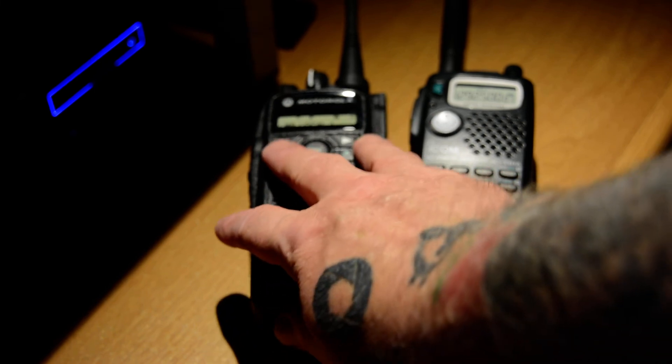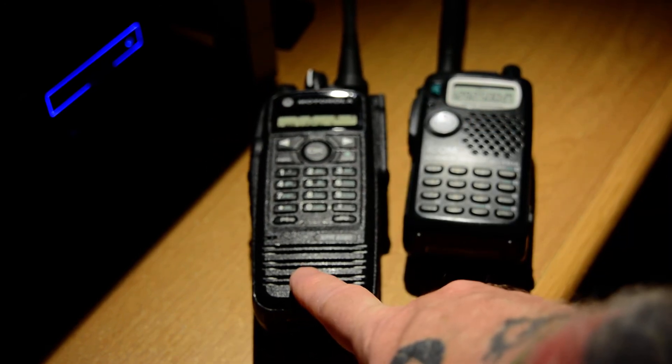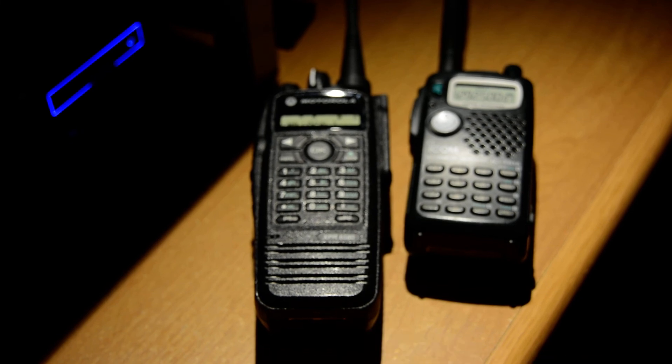I know I haven't moved the camera around a lot — it's been kind of stationary. But I wanted to get out there and play around with both of these bands this weekend. Currently I have this one on my local DMR — I'm going to leave it there all weekend and hopefully scare up a contact or two. If not, I'll go over to the FM repeater and try that. See if you have a 900 MHz or 1.2 GHz repeater in your area — if you have the gear, give it a try. Give a call out; no one's going to hear unless you call. What about a net? There's another opportunity. I'm trying to get a 220 MHz net going in my own area through my club, because we have five or six 220 machines locally. It'd be great to get these underutilized bands used and working.